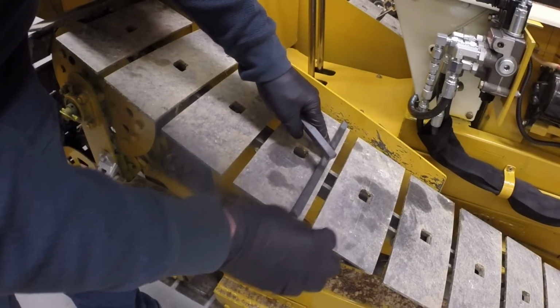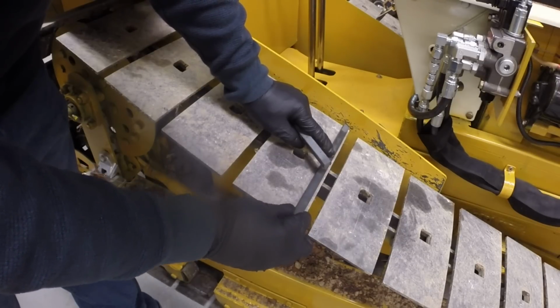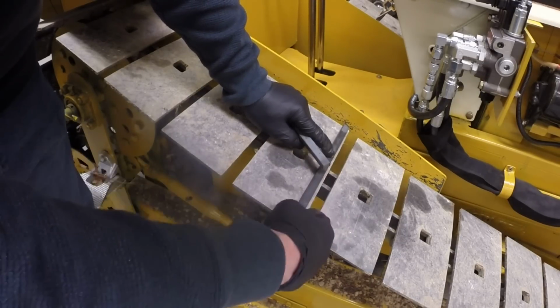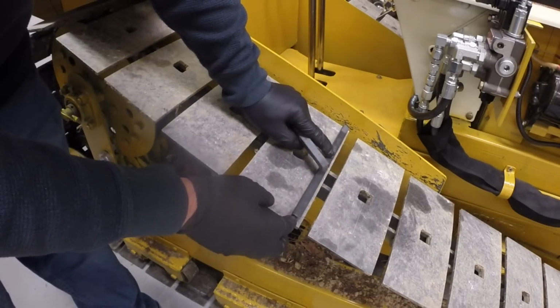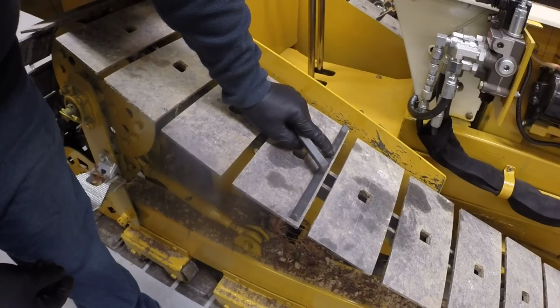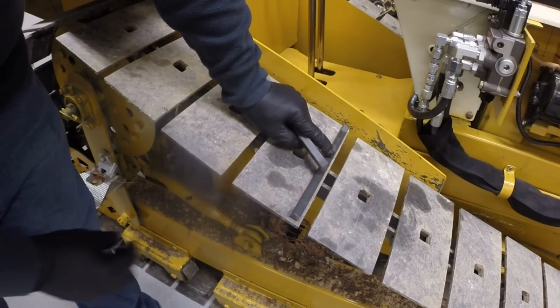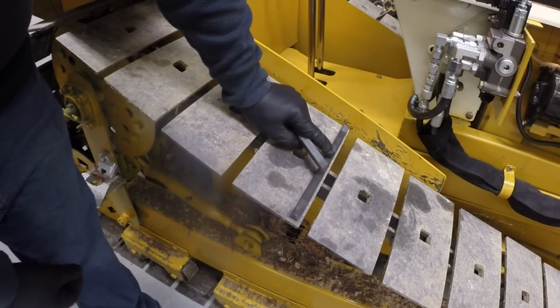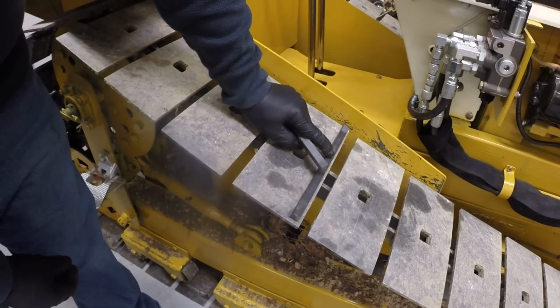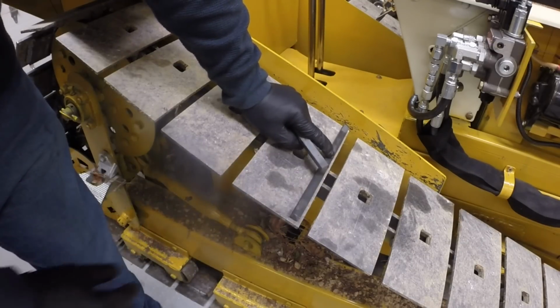Let's fabricate a jig to hold them in alignment, just an eighth of an inch or so off the front edge, and I've got them a quarter inch off of each end. So I'll probably make up a little jig that will hold them in the right arrangement to tack weld them, and then take the jig off and finish welding them. Okay.